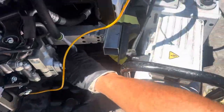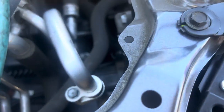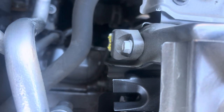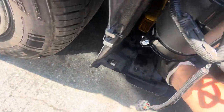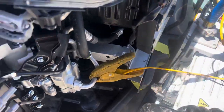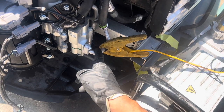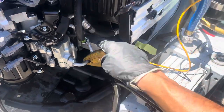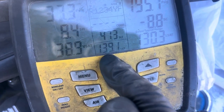Let's see the discharge pressure coming out of the compressor. I need to chase this down and follow it — I'm pretty sure I can't get right on there but I could get close. Let's get the discharge temperature coming out of there. Even though we're really far away from the compressor, it'll give some idea of what's going into the condenser. This is not the liquid line — this is vapor, high-pressure refrigerant out of the compressor — but we're going to read it on the sensor labeled LLT, which is liquid line temperature. We have near 140 degrees coming out.